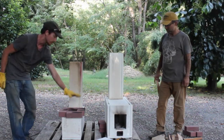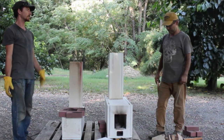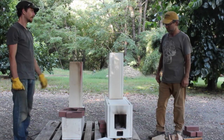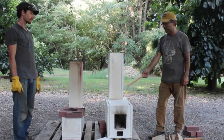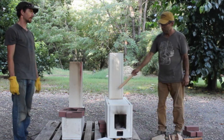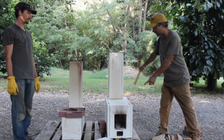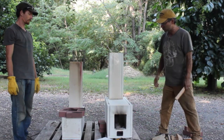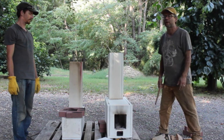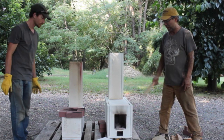You can slowly damp the J-tube down, but it's never like a door that just shuts it closed, so you can walk away and feel safe. This batch box is a lot more similar to a stove you've already run in your house — it looks more like a conventional wood stove. The problem is it's bigger and it puts out a ton of heat. For my particular purposes that's a slightly larger footprint — a little bit longer, a little bit wider, higher riser — but what I'm mostly concerned about is getting something sized for my space. I have some tight clearances to deal with, but I love the way this burns.